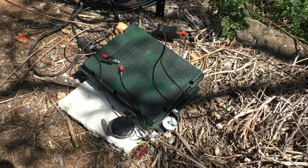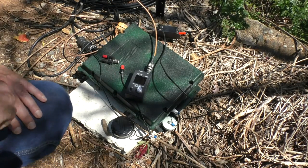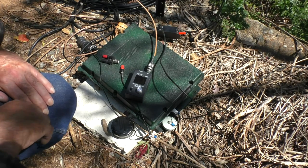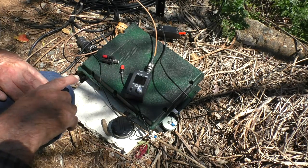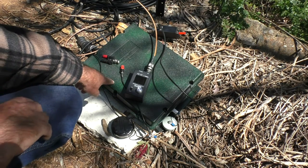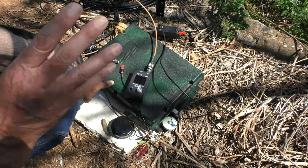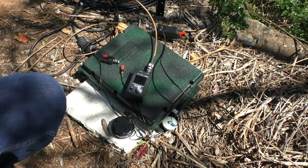So you can see this antenna has very, very high impedance. By using the 9-to-1 unun I can get those very high impedances down to an impedance that wouldn't be too much of a mismatch for the coaxial cable, and I could tweak it in with a manual tuner in the house. This auto-tuner will tune most of the bands, but I'm not sure they're designed to tune impedances of 1000 ohms or above.